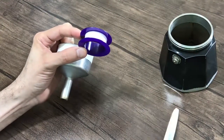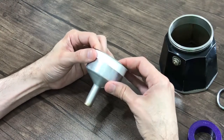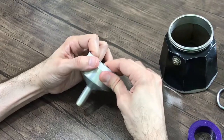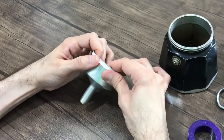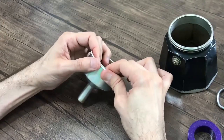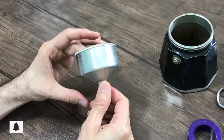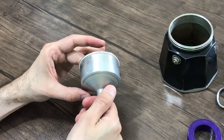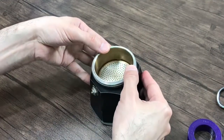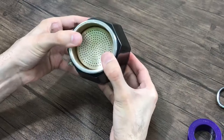Cut it after 2 rounds. Then, using your thumbs, roll it up. You are trying to create a white ring made of PTFE material. Once the ring is created, the funnel is quite fit into its hole, so the vapor cannot escape and the rubber gasket or the washer can seal it very well.